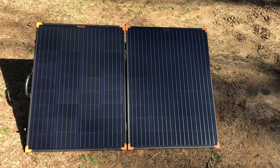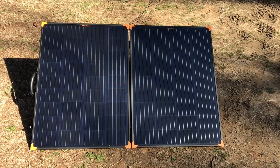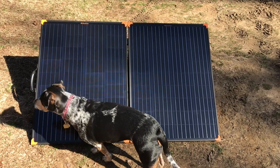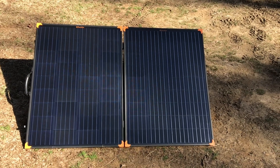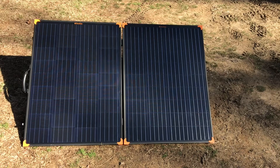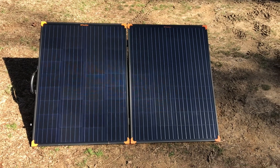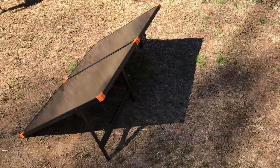What is an EMP? It's a high-altitude electromagnetic pulse. From man-made versions — nuclear weapons detonated high in the atmosphere — you get three pulses: E1, E2, and E3. The E1 pulse is the most dangerous to your off-grid solar power system. It can produce up to 50,000 volts per meter of ionization, because it ionizes electrons in the atmosphere from gamma rays, and it lasts nanoseconds. You need transient voltage suppression protection to stop that — we'll get into that further in the series. This is what's going to smoke your charge controllers, your inverters, all that equipment.